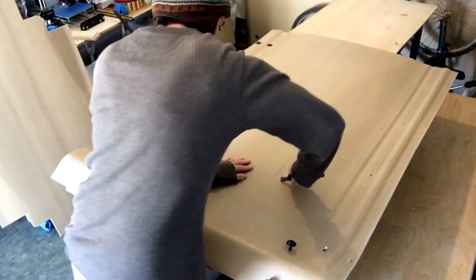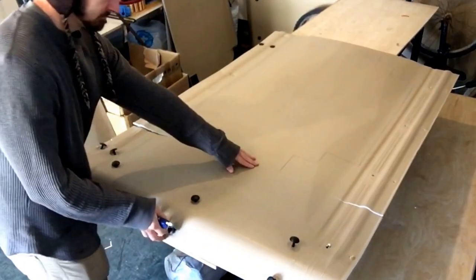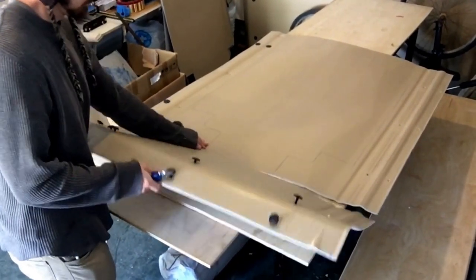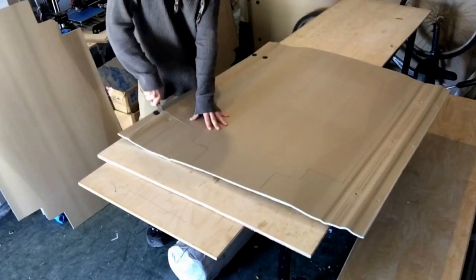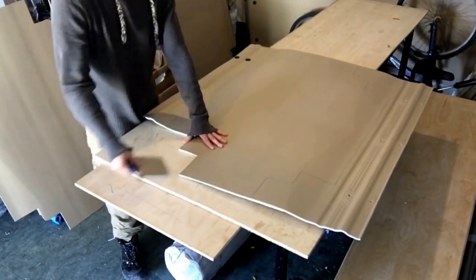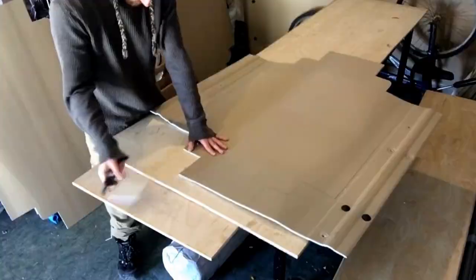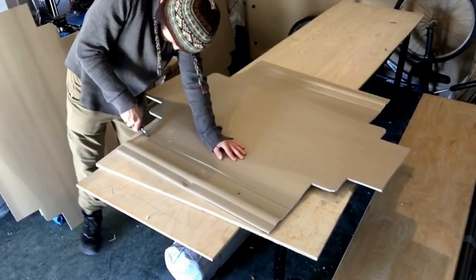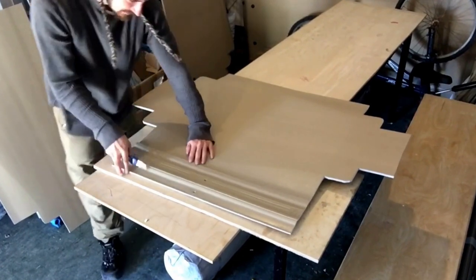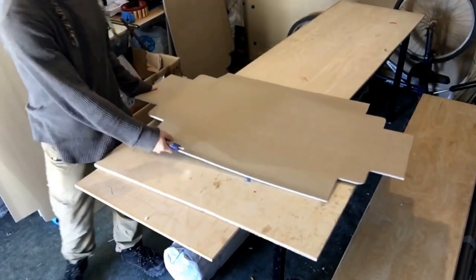The plastic panels can be cut easily with a razor knife. Pushing down on the middle of the seam, pulling up, it snaps easily and separates quickly. Rather than trying to cut along the entire outside of the pattern, just remove small squares so as not to break the corners of the remaining piece. Once you've measured and cut the first piece, save it as a pattern to trace the others.